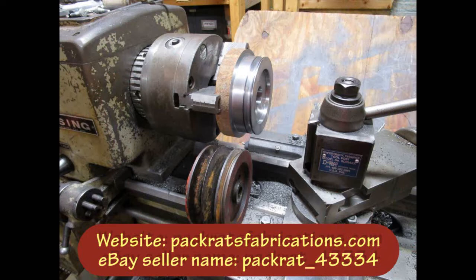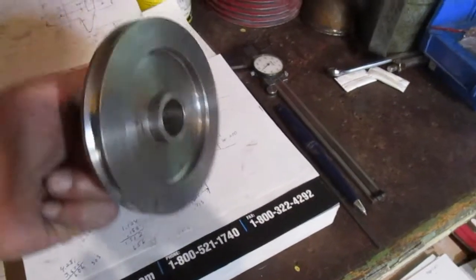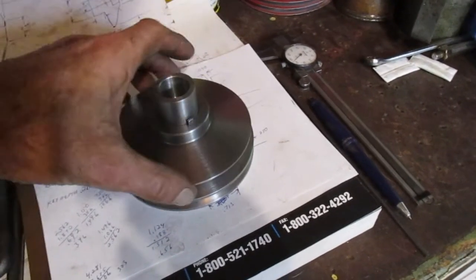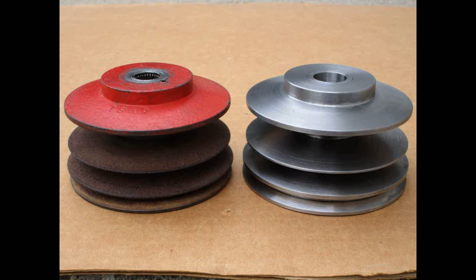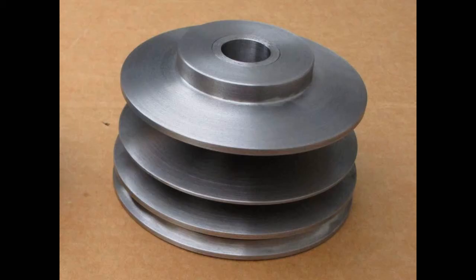There are four main parts to this pulley set. Here's a picture of the first part partially done, and here's the center shaft sitting on it. This is the rear section finished with the center shaft pressed into place. The center shaft has a Woodruff key so the center section can slide on the shaft but not rotate, and then the top section is pressed onto the shaft. The center section is trapped in between but can slide back and forth. They all get new needle bearings — that same part number is still available. All three parts that the belt rides on are made of cast iron, and the center shaft is made of steel, so this will be identical to the original.